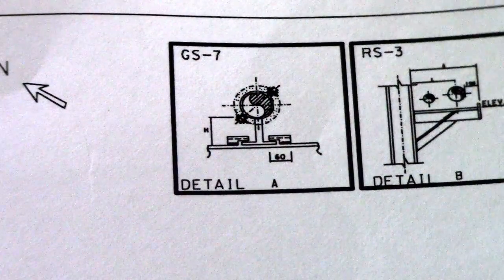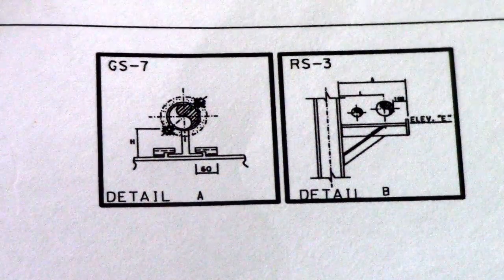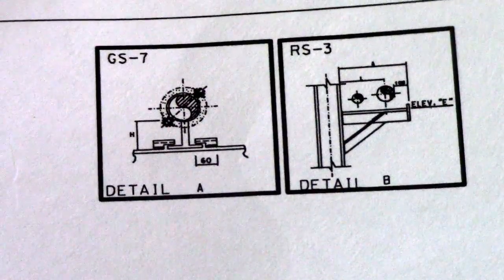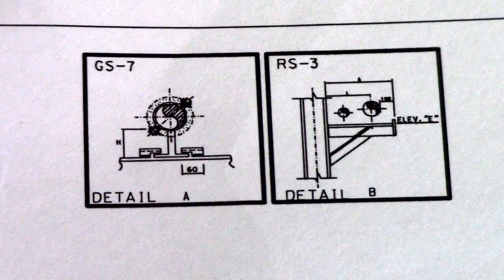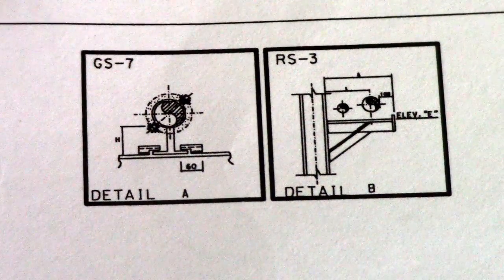That orientation of northing is important for piping — if you are going to fabricate and install from the field, okay. That is the first thing to be checked: the orientation of northing. And from the isometric drawing, this here is the support details.